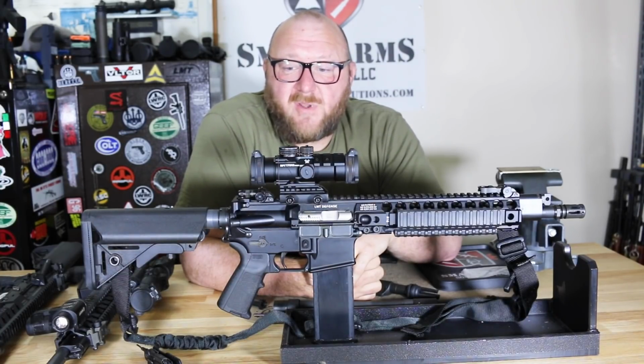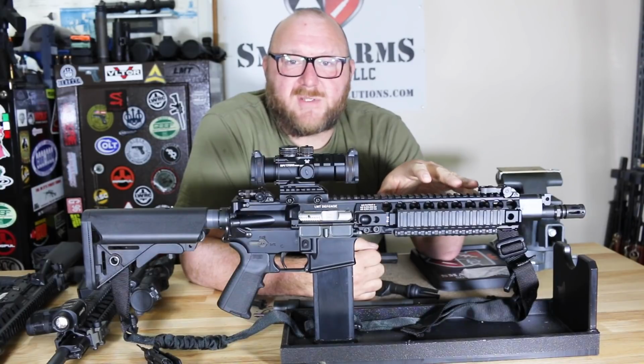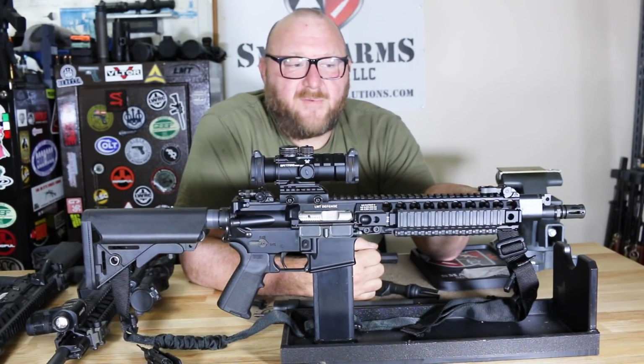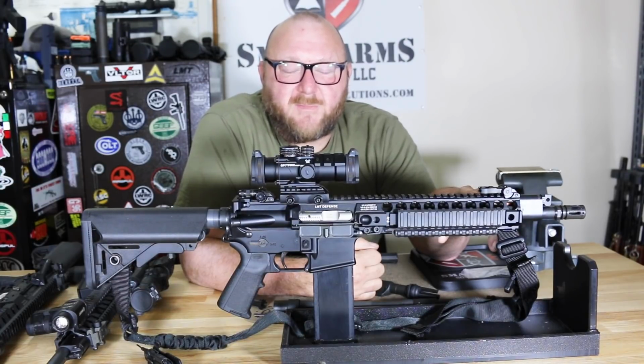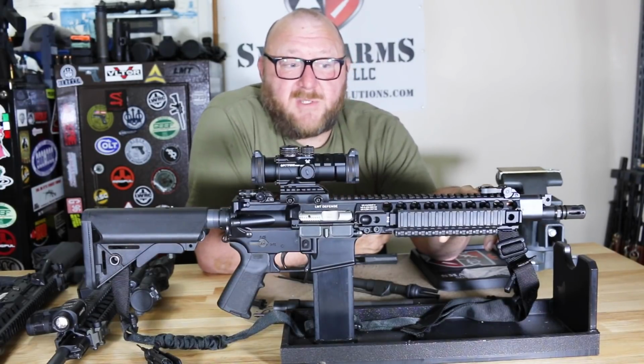The other thing you will also notice is, as far as durability is concerned, what's going to cause a rifle like this to fail is not going to be whether it's internal piston or external piston. It's going to be temperature. If you were to take this rifle with, say, a 14.5-inch barrel with an internal piston, and another rifle with an external piston, and you were to fire to destruction, the barrels will fail at the exact same point, and that will be due to heat.